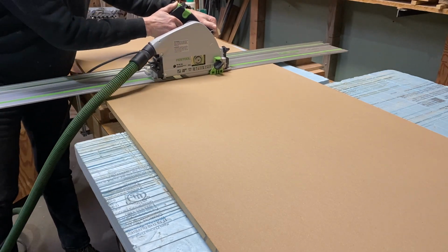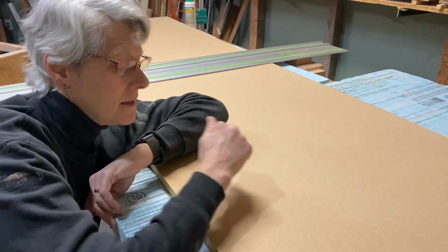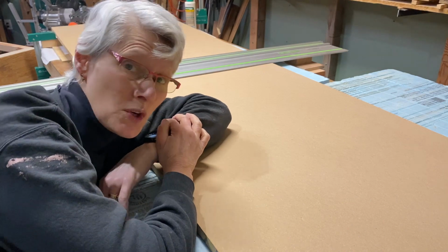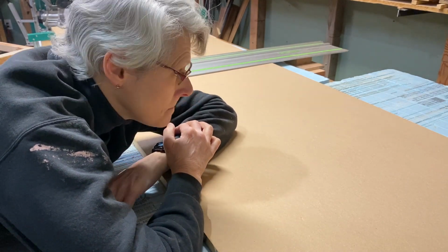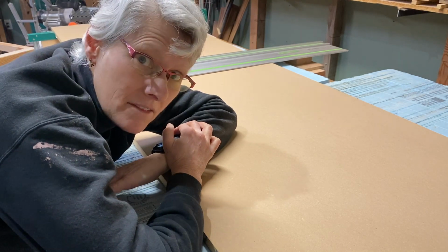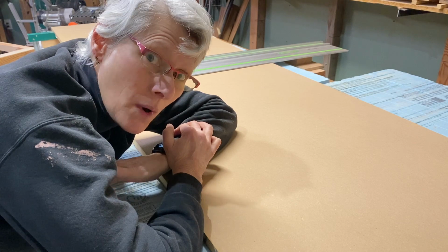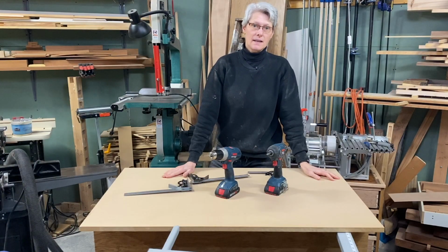Best tool tips and tricks. This 2.5-inch hard insulation makes a great backer when you want to cut pieces out on a big sheet. We have ours cut in half so that we can put it on 2 4-foot wide pieces or stretched out for the length. I've got the top cut out of the MDF.